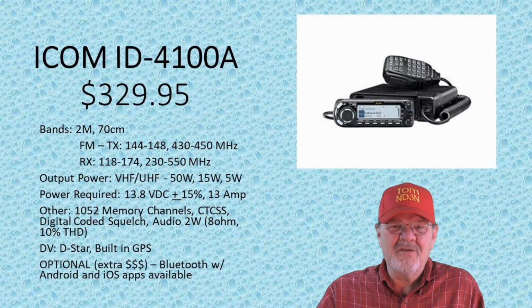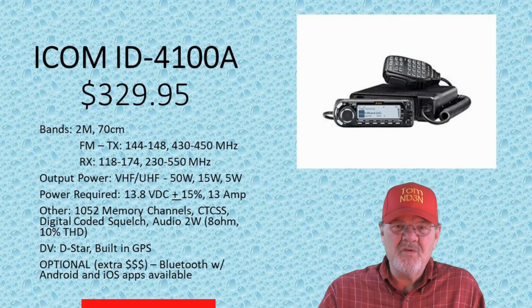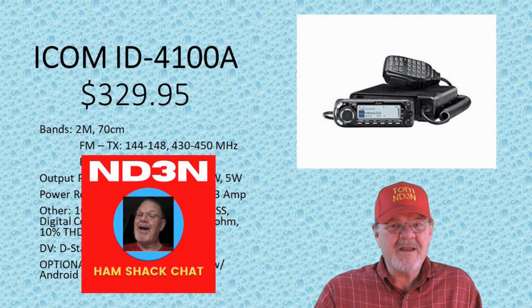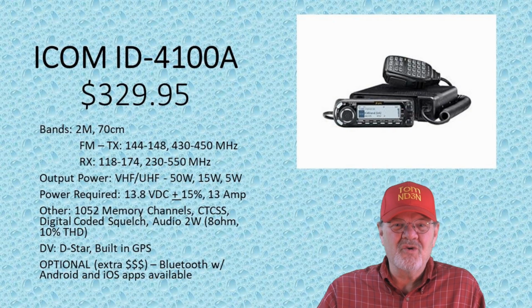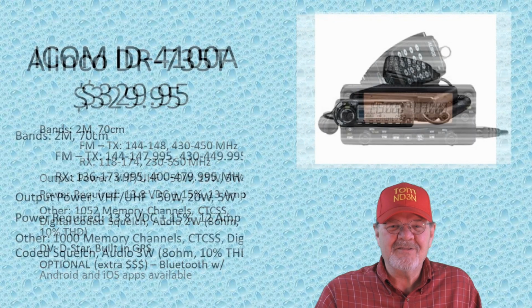The output power is 50 watts, 15 watts, and 5 watts. The current is 13 amps when using the full power. This rig has 1052 memory channels, an audio output of 2 watts, and has built-in GPS. Again, Bluetooth is optional, but this time around they're also giving you an app where you can control your rig, available both in Android and iOS.